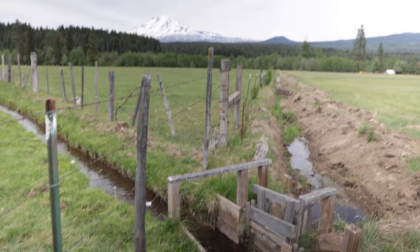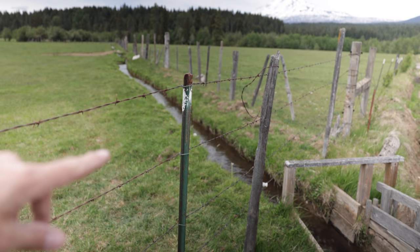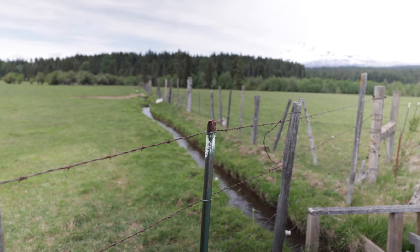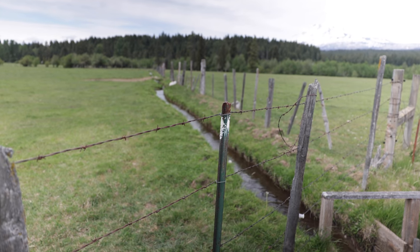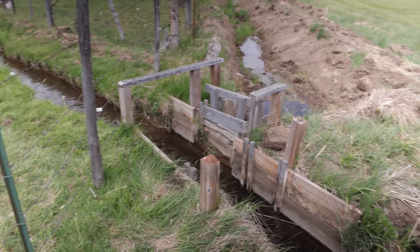It's going to need some pretty extensive rebuilding — the head gates and such — and that's kind of where I'm getting started today. I'm doing a survey, kind of a material list of what I'm going to need. I'll explain how the irrigation system works and how by just changing gates we can flood irrigate our entire acreage and never have to pay for water, pumps, or electricity. It all starts right here — this ditch right here. The water running in it right now is about 10% of what it would normally run because the other folks upstream are irrigating. There are only so many shares of water rights in the valley, and we happen to have a percentage but we're at the very tail end of it — whatever comes to us, we're able to use until it goes back into the river.